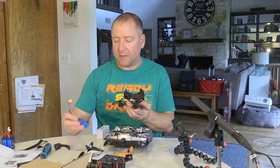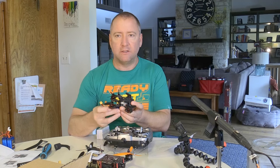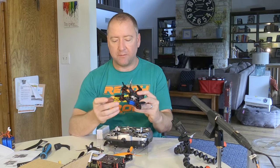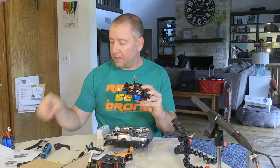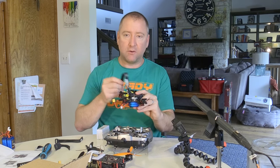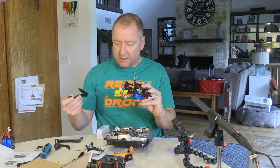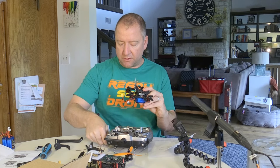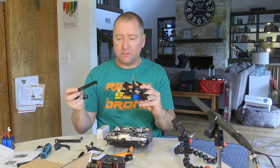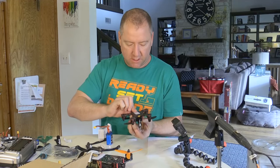The thing I had trouble with yesterday was actually attaching the battery onto the drone. The way that you see it done in the pictures on the website and in the instructions is it goes on the bottom, the connector goes right here, and you use these straps. Well, the problem is one strap is not actually long enough to go all the way around and loop back on itself around the body of this thing. So I figured out that you have to wrap two of these straps together, which is not a huge deal. I managed to do that without any trouble. But just be aware, if you're frustrated when you put it on, that you actually have to wrap two of these together.